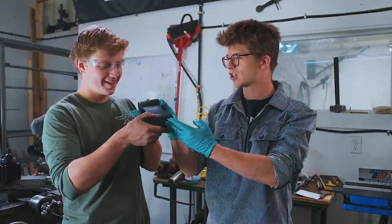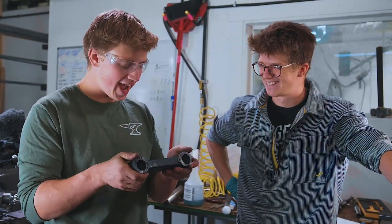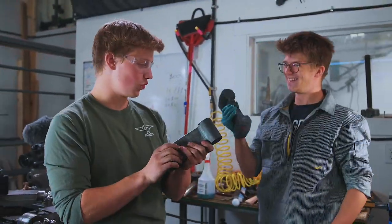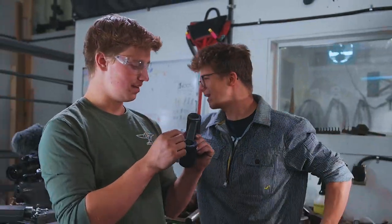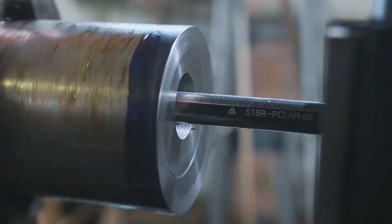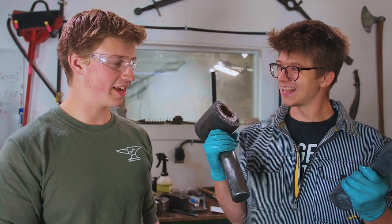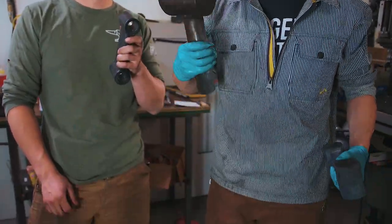Mr. Stelter, here is your first toggle link. This thing looks absolutely fantastic. I forged it and then machined it — that's wild. So I've got to finish up the second one. How's your piece going? It's coming along very well — this little tiny boring bar is taking a pretty hefty cut and doing great with a really slow feed rate. How exciting is it that we get to remake these old parts from scratch? I thought the hammer was in working condition. Well, you were told it was — this is incredible, what a journey, what a huge amount of fun.